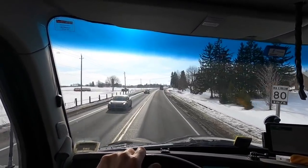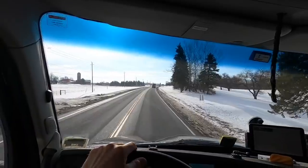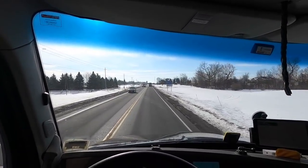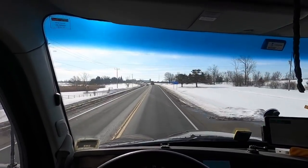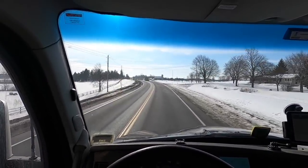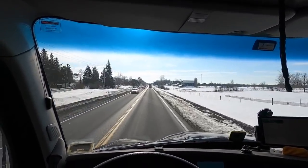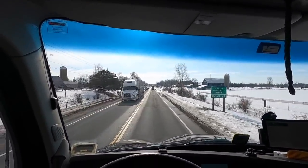And of course I didn't expect the weight difference to be 7,000 pounds between the 60 ton and 55 ton. But still, you see now, right? I'm going to load a 70,000 pound or whatever, 66,000 pound rock truck. I can still do it with just 7 axles. I don't have to bring the 8 axle. But something like a Cat 336 or heavier, I would need another axle.